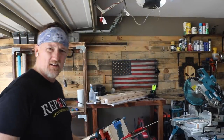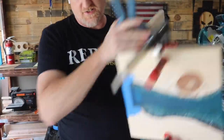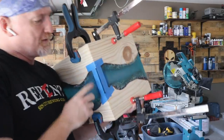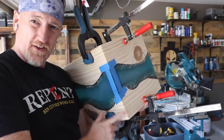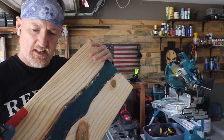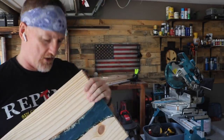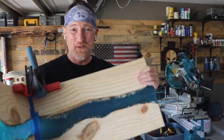What's up guys, it is the next day again. We've got our glue-up going on here. So what I'm going to do is put just some small L-brackets in here — those should be kind of hidden. I tried to fill that void yesterday, just putting some epoxy in there and letting it sink in, but I come out today and there's still a little bit of a void. So I'm going to chamfer this edge — all the other edges are chamfered anyway — hopefully that will mitigate that. Then I'm going to build the base for this, which is basically just going to be a U-shape that comes out here, and we're going to take the torch to it and hopefully get some finish on it today. I'd like to have this 90% if not 100% done today — but this thing's been nothing but roadblocks. Wish me luck.